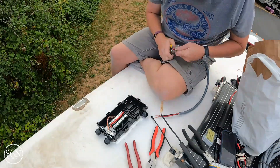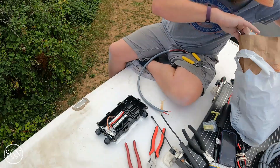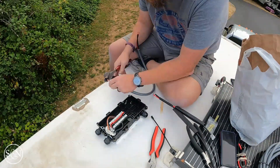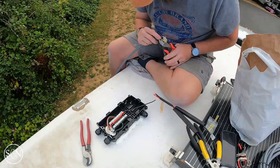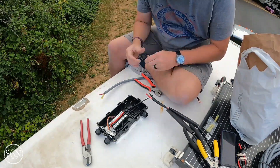I'm stripping wires here for both ends. One end connects to the wire coming off of the solar panel — you can see it there, right next to the heat shrink jacket. The other end goes into the solar combiner box.